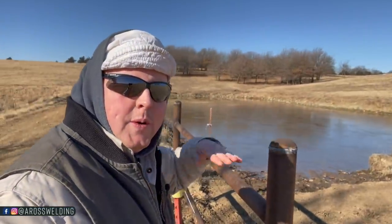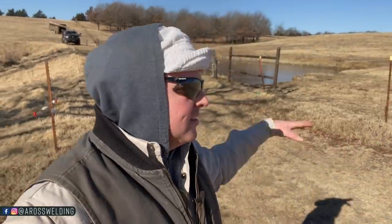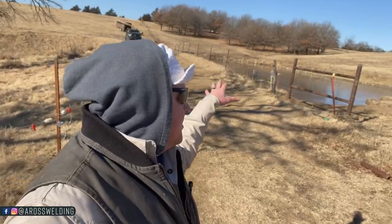And you can see maybe a little lower, but you can't never tell because the ground isn't always the same. So all that to say, I used my body to measure. I didn't use a tape. I just put the string line on and then I just adjust it according to the ground and according to how the fence is going to be pulled off of it. Cause I'm not going to be stretching the fence on these braces. The landowner's going to do that. But whenever I put a brace in, I want to do my best to keep the wires parallel with the braces. So that's where the eyeballing comes in on a brace.